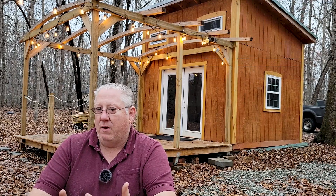I really don't need 14 kilowatts, but I want to be able to charge the batteries up in five hours. When we start looking at our power needs, if you design your house with off-grid in mind, it allows you to make some decisions that can make your battery bank last for days and days. Looking at heating and cooling as an example, I'm going to try to do zones using mini-split-type heat pumps where I can, in times when we need to be on limited power, heat or cool only a smaller portion of the house and really extend the amount of time the batteries might last. My goal is to have at least 72 hours of power in the batteries with no external energy, whether it be from the sun or generator.